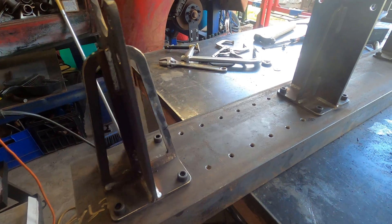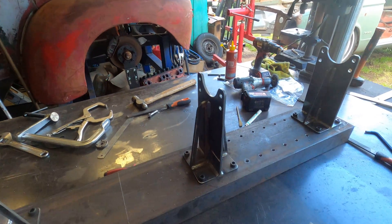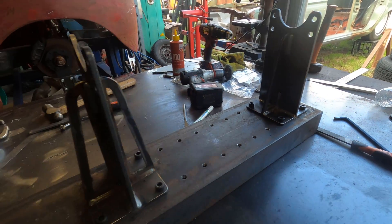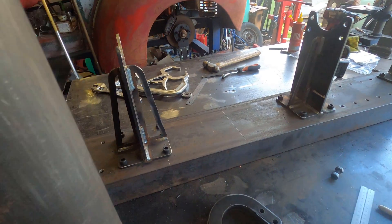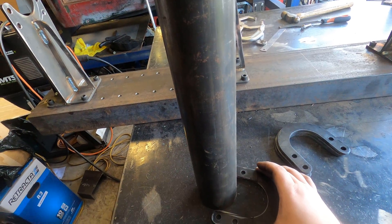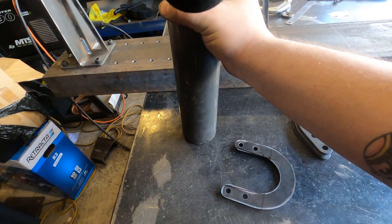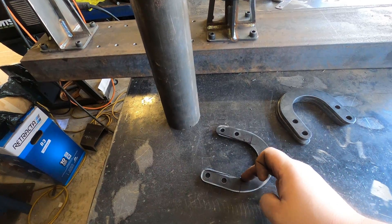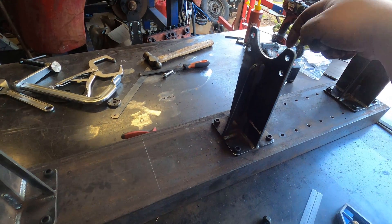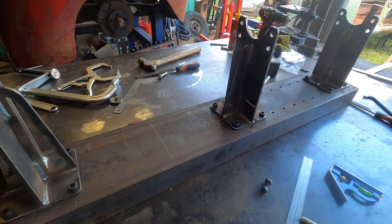Next day — I've come out, tacked everything up, actually welded them all off. We bolted them down to the PFC to weld them so they hold and cool on the PFC as well. The gussets are just stitched so I need to fully weld them. One thing I found moving into the top saddles — they're the correct size but they just need a little bit of clearance to let the tube go all the way to the top. I've marked them off the tangent — I'll bolt them all together, sand them all at once. I'll get the die grinder in there to get it where we need it.